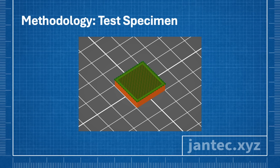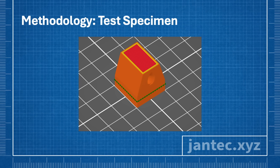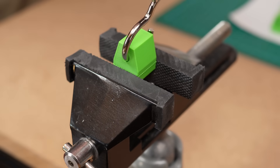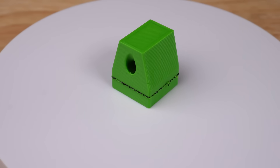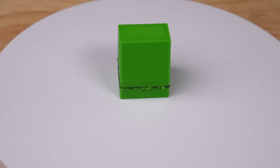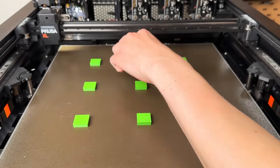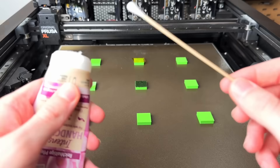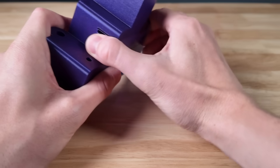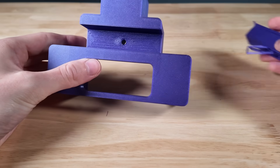Here's the plan. First, the printer creates a base, then prints two top surface support layers — exactly those layers you get when setting the top contact Z distance to 0. Next, the specimen is printed on top. If the release agent works as intended, it should take little force to pull the sample from the base. This gives a clear, objective way to determine which release agent works best: the one that needs the least force to remove. I'm printing 9 specimens simultaneously, each with a different release agent applied manually during a print pause, right at the interface between the supports and the object. Later in the video I'll show real-life applications and do practical tests.